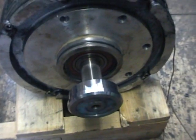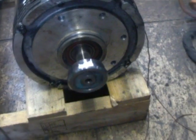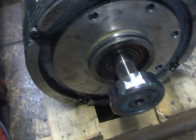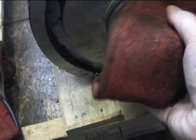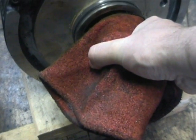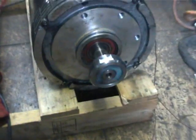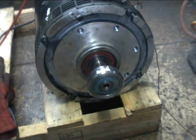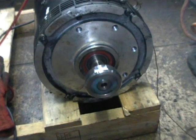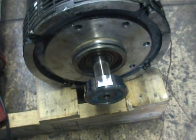Connecting the battery now — we can see the shaft is spinning up happily. If I apply a load to this shaft, you can see the more I squeeze it the slower it gets, but the slower it gets the more torquey it becomes. That's the characteristic of a series DC machine: torque is inversely proportional to speed — the slower it gets, the more torque it has; the faster it gets, the less torque it has.